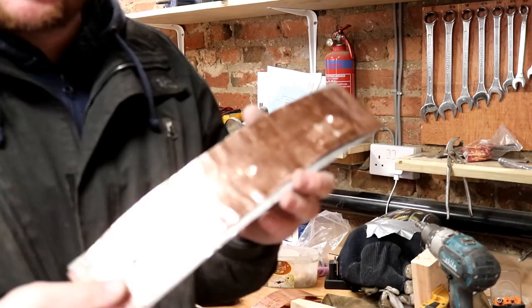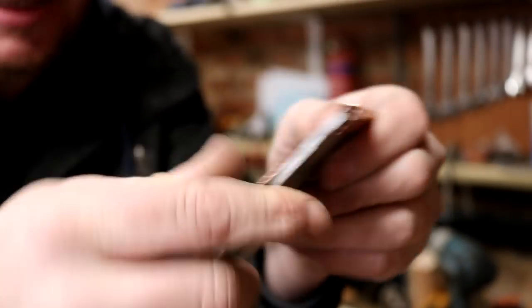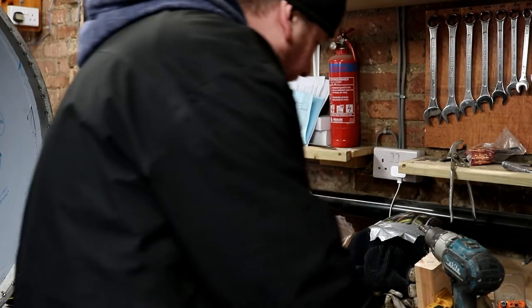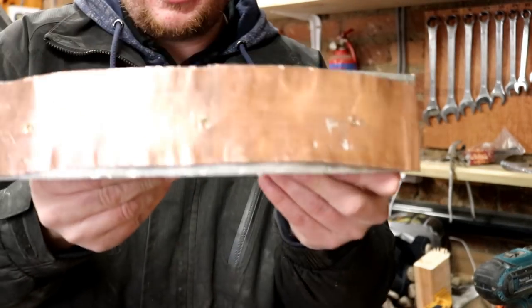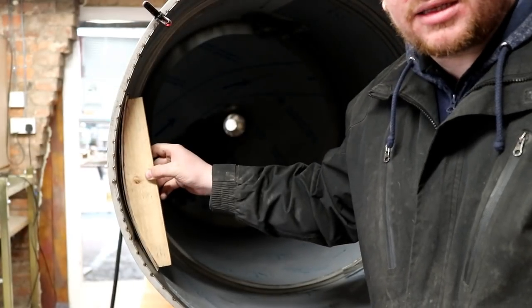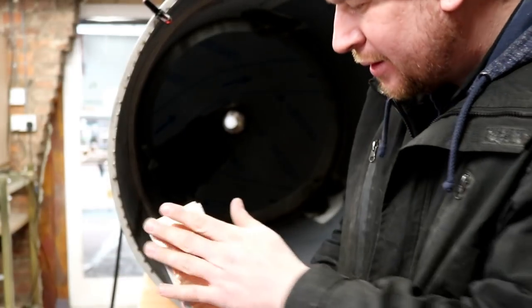I've got really fancy now - I've got the aluminium and the copper strips that we've made previously and I've sort of sandwiched them together. We just bent it round, and she's clamped on there pretty tight. I've put some screw holes in, run it through the roller, and she fitteth on top. Just countersunk the screws so we should get a nice tight fit. So that now is going to be the backing bar for inside the tanks. Once she's clamped up tight, I'm hoping that she will be a good prevention for the coking.